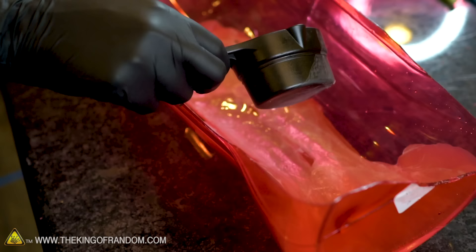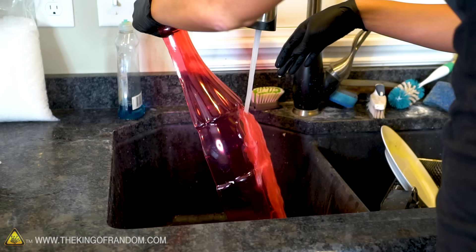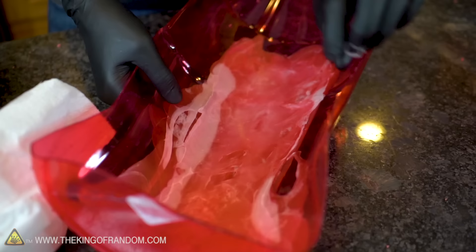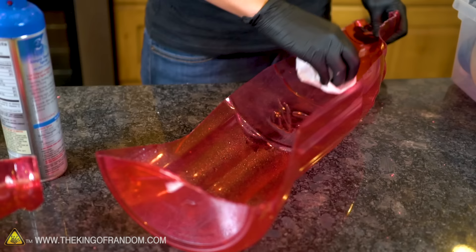This won't be as thick as our final, but we want to see if it's going to peel off all right. My plastic is definitely warm to the touch, but it doesn't feel like it's lost any of its structural integrity at all, which is awesome. I'm going to run some cold water over this side, and once this wax is actually cooled down to room temperature, I'm going to see if I can peel it out. This does look like it's going to peel out okay, except with all these little divots the wax is absolutely going to crack, especially if I leave it this thin. I'm actually going to try and hit this with some baking spray — see if putting some grease on the inside will help the wax release a little easier.